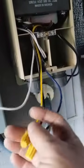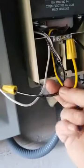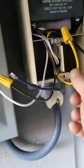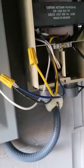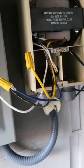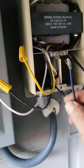We have several different options on the high voltage side. If we connect our line voltage to the black wire, we get 12 volts output. If we connect it to the yellow, we get 13 volts, and blue obviously is 14 volts. The white wire is for the common neutral. In this situation we have a further run from the transformer to the pool light junction box, so we're going to end up using the blue wire.